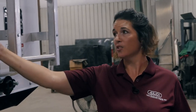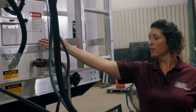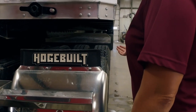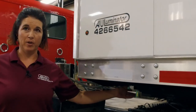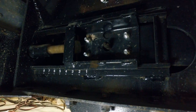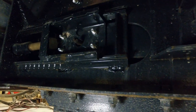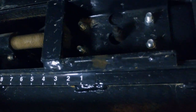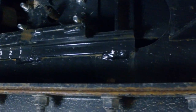Each of our trailers has access through the front doors as well as underneath the side. Underneath you'll notice the front take-up sprockets. These are where you measure and square up the front sprocket when adjusting the chain. These sprockets are independent — there is no shaft in the front. This allows for some forgiveness; no shaft to twist and break.